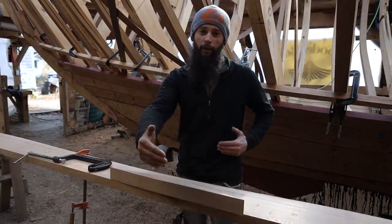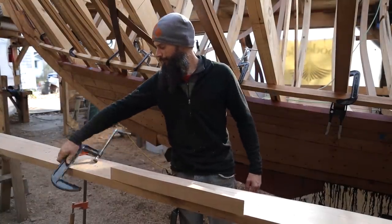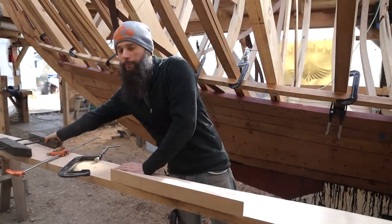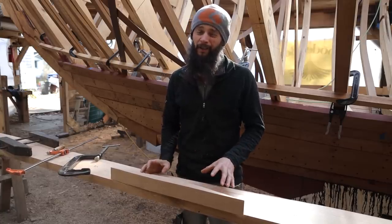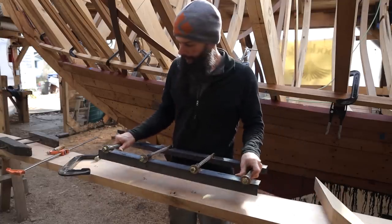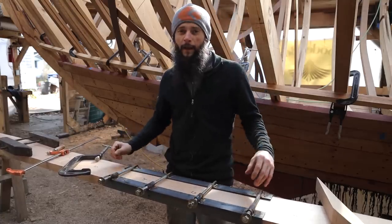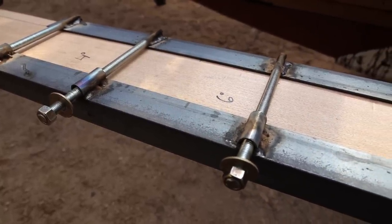We were thinking about the clamps going one way, so the glue boxes are really tall, but we didn't think about width. If we put a C clamp on, it sticks out super far — same thing with a bar clamp. Even our old school wooden ones end up being too wide to go into the boxes. If we cut the plank down to about 6 inches we can put a 6-inch clamp on it, but that means we have to cut the plank out to shape before we can put the graving piece in, and we really don't like that. So the solution we came up with is to make a couple of these metal pieces that can flop over the plank, clamp down to the bench, and apply pressure on the graving piece — nice and narrow to fit inside the box.